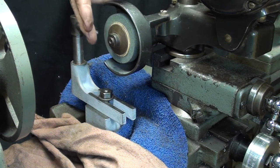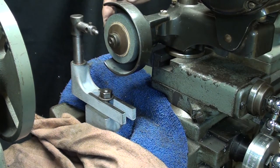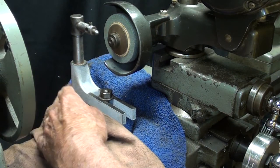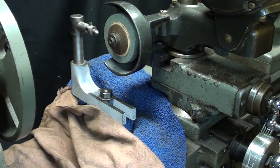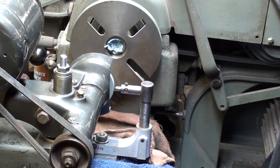You may not be able to see this in the video. I will be looking down this way, and probably the color of the face of the wheel will change as I do that. Be sure and wear eye protection, preferably a full face shield when you do this. Okay, here we go. The first thing I will do is start the grinder and touch the wheel off so it's just barely touching the diamond.